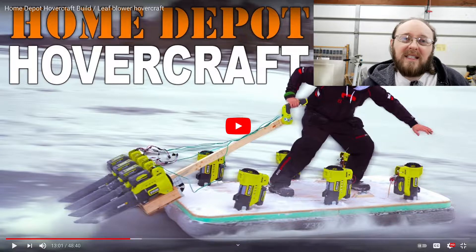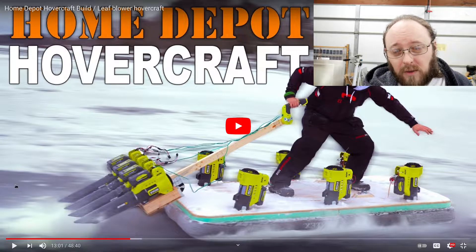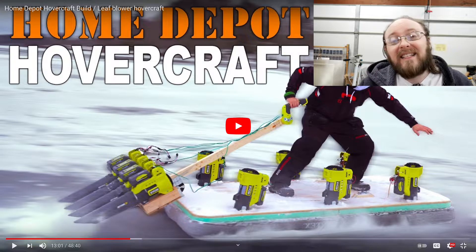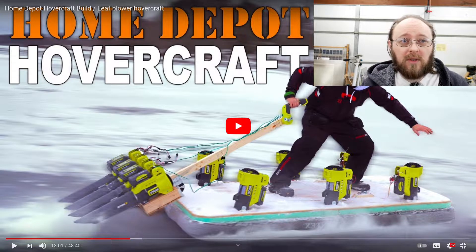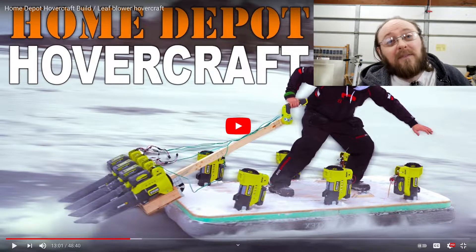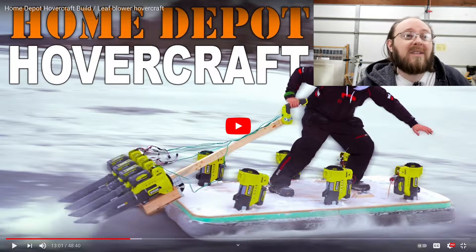In Fowler's video, he states that his biggest disappointment about the entire vehicle was the propulsion. The trick to making that better would be to take these leaf blowers and instead of pointing them downwards, point them straight backwards — that would make you go forwards most effectively. The way to think about it with a leaf blower is that the fan blades are pushing air backwards, and the air in turn pushes against the fan blades, pushing you forwards. Action, reaction. Pushing them down doesn't make your craft go faster, because you're not getting traction with the ice — that's just not how it works. Instead, pointing the thrusters downwards just pushes the back of the craft upwards, wasting power.